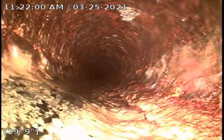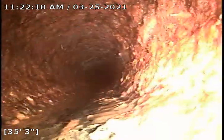This is in good shape. I would not complain about this whatsoever. We would only be concerned if we see it change to Orangeburg. That's a little bit of a bad pipe. Usually people have to replace it right away. In this case, cast iron looks good.